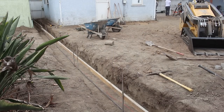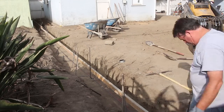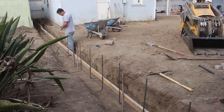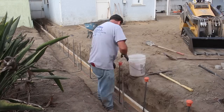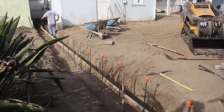You can see how I set those boards stepping up and down between the garages because the footing elevation changes there. The rebar is basically going to be the same since it's only a four-inch transition — if I was going up a hill I'd have to lay the board bars on an angle, but I didn't have to bend anything to make that transition on the step footing. We're also alternating tails on the block wall every two feet, turning the bar in the opposite direction so you have lateral strength in both directions — basically for wind resistance.